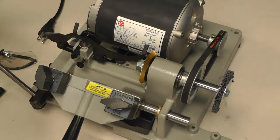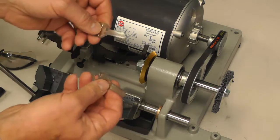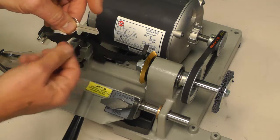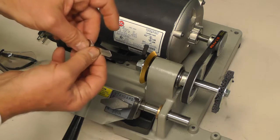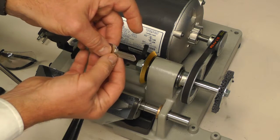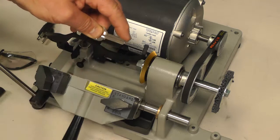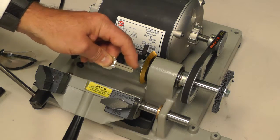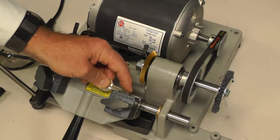By taking two identical blanks — for example, two KW1s — I also like to tell you the proper way for good key cutting techniques: how to hold a blank. It's very important. You want to hold the head of the key with your thumb and your second finger behind the head, and putting your index finger on the tip. This way you get a solid, nice, even hold on the bottom of the jaw rest to firmly put it in.